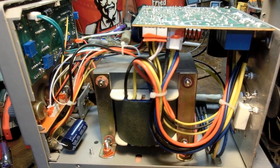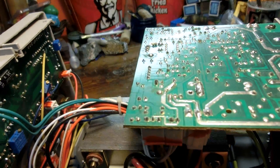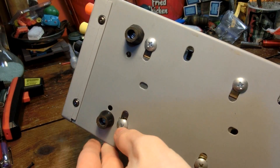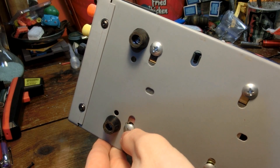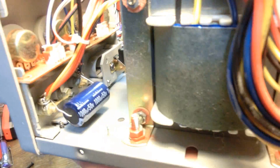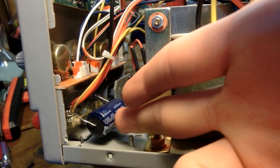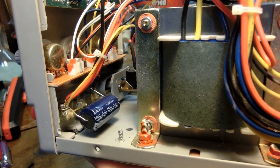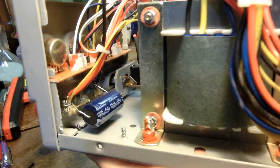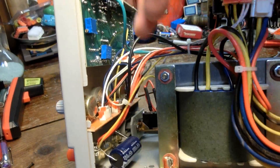Here are the internals. Even though it looks pretty cheaply made — and it is pretty cheaply made — it's actually been very reliable and I've thrashed it pretty hard. I think one time I let this sit putting two amps into a lead acid battery for three weeks straight. You can see here is a capacitor that I added to it, because I accidentally reversed the polarity and fried the original one. I added this one and it's helped, because without it the meter gets messed up and the voltage fluctuates a lot.